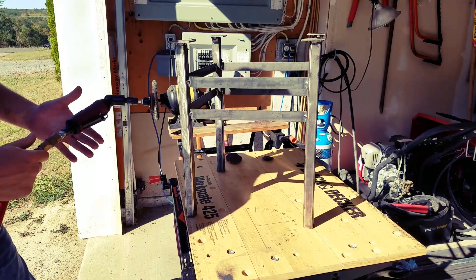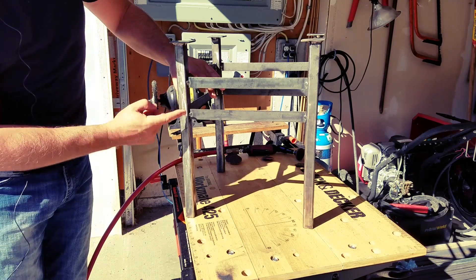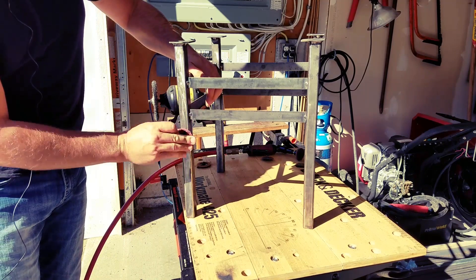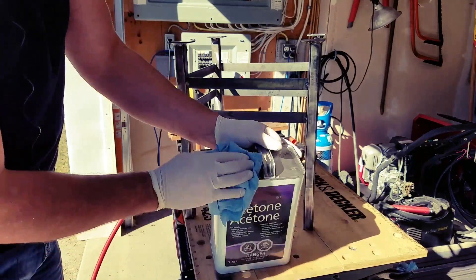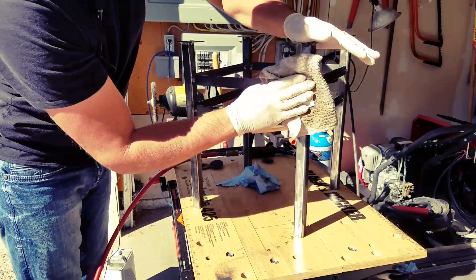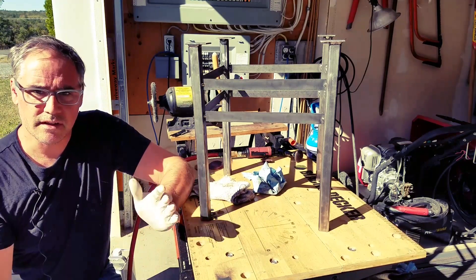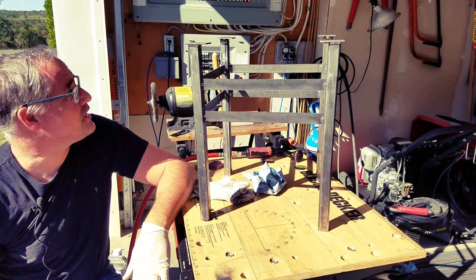It turns out really nice and shiny, but you have to put an oil into your pneumatic tools, and because of that it puts a drop or two of oil on this piece. There's a part to prepping this — not only do I need to scour it with these pads, but the second part is de-grease it. And the way I do that is with acetone — a pretty good soaking, just wipe it down. It takes it right off and evaporates immediately. And all done and dry — the evaporation was probably a little bit heavier because of the sunlight. It is clean and ready for paint.